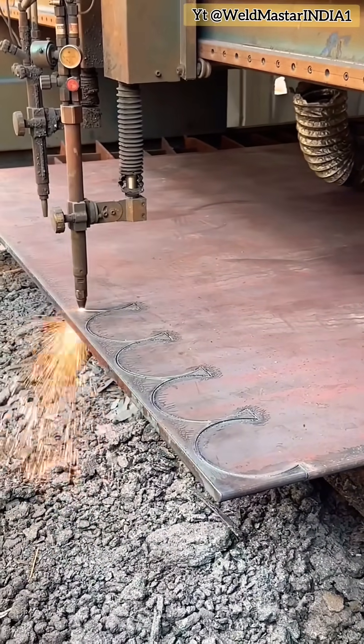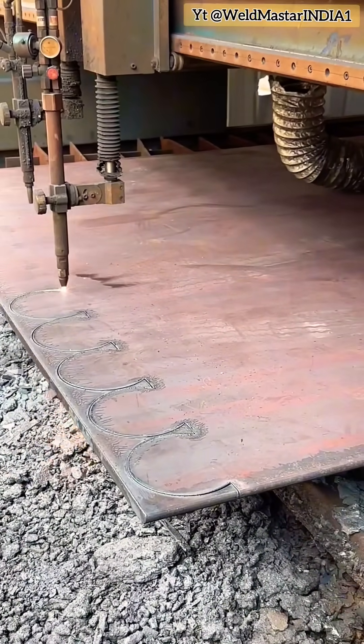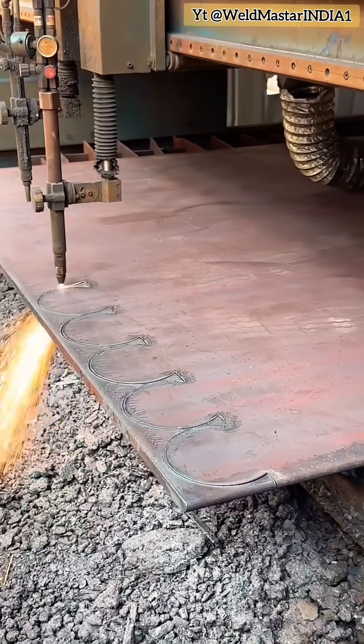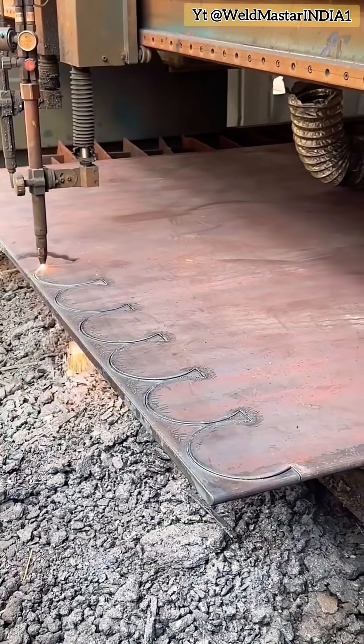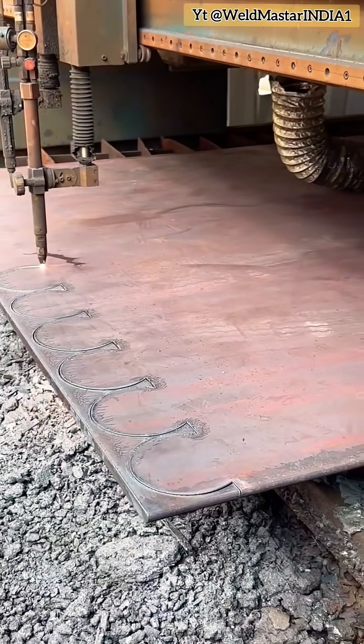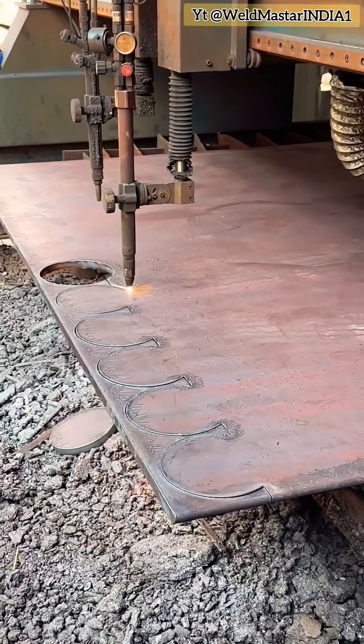Some people ask: did you leave too much on the plate edge? What if the plate tilts and you can't cut all the way to the end? In fact, if the pattern extends too far, it can't be seen clearly anyway, so we just return from there. You can see here, as we cut across, the piece drops off — right at the end, it falls away. That shows the bridge width was just right.